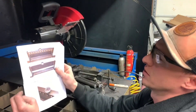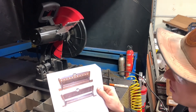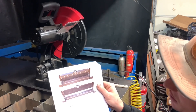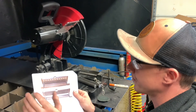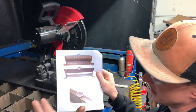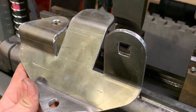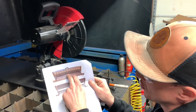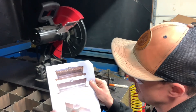Most of you are probably going to be familiar with the Swag Off-Road press brakes. There are only two components really that are proprietary or unique that you can't buy otherwise, and that is the pinch clamp up here that holds the fingers and the brace on the bottom. You could work your way around a couple of those fairly simply. The big difference here, as you can see, this is a fixed lower plate. Like if you have a 10-inch wide piece where only a couple parts need to bend and the others need to stay straight, this is not the press that's going to get that for you. These fingers come in handy, but only in certain applications. Even their demos online show pressing a certain area and keeping a certain area straight, but you're in effect bending the plate in areas that you don't intend to.